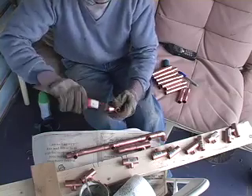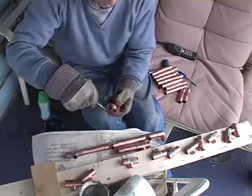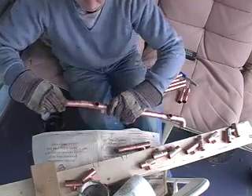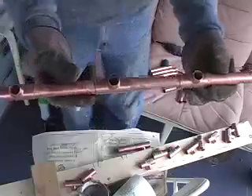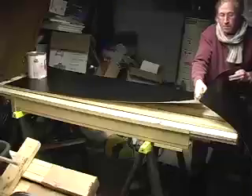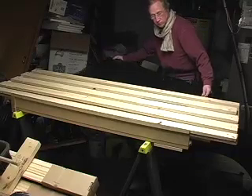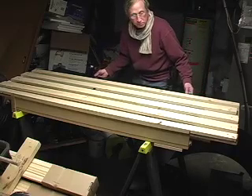You have to be good at plumbing. You've got to be able to solder all these joints together, measure stuff. Here I am doing the basic plumbing work — cutting, getting everything ready for the joints. This is the header; it's three-quarter-inch copper, and it's going to transfer the water up the half-inch pipe to the other header and out of the collector. Here's the aluminum flashing I used as an absorber — this makes everything hot inside the collector and transfers the heat to the copper pipe. This whole thing cost me about $2,000 when I add up all the parts and my labor.